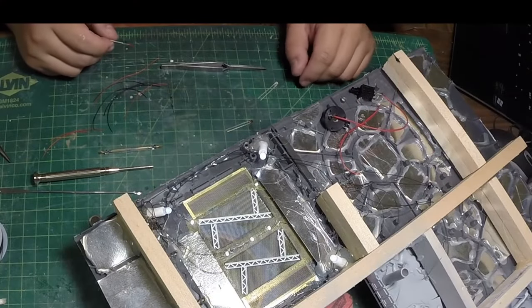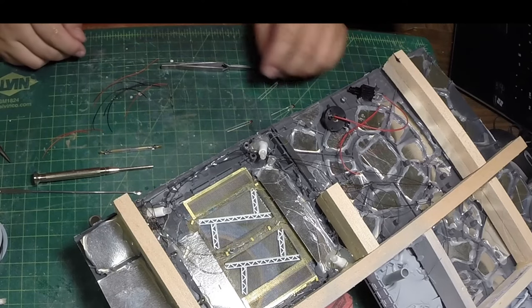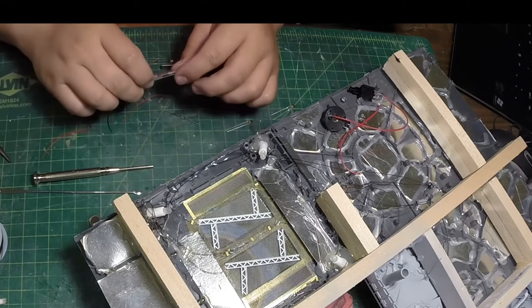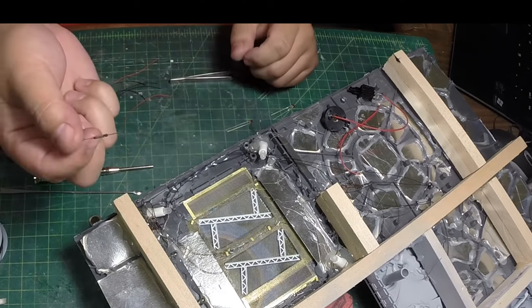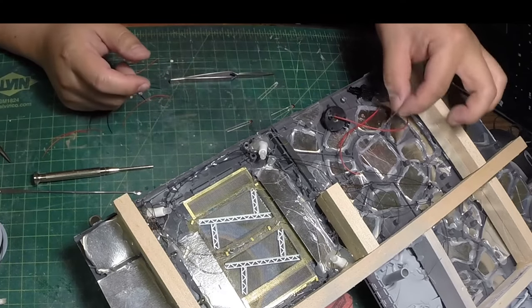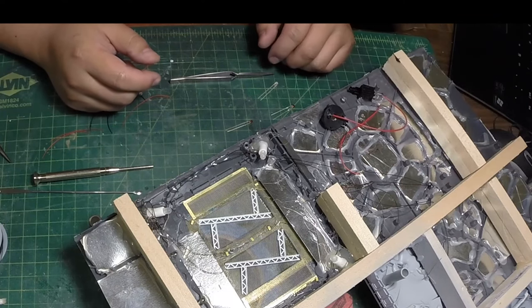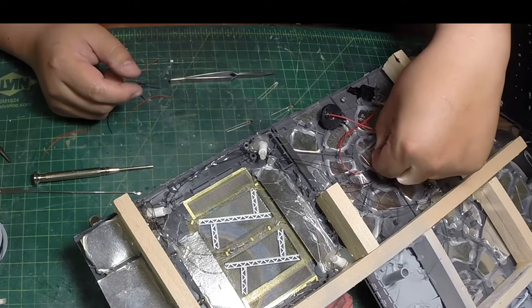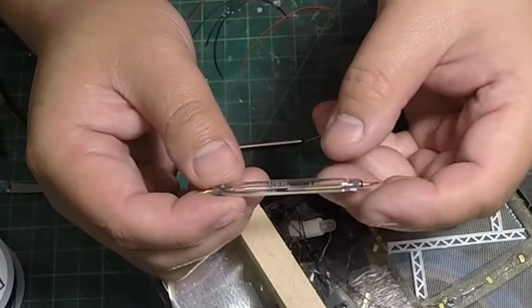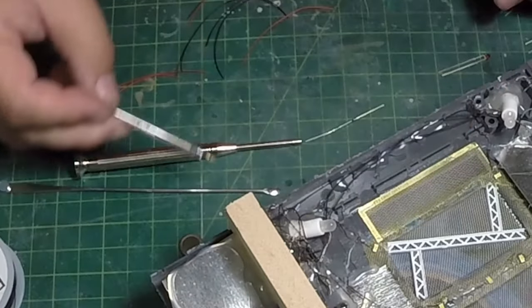What this means is I'm going to have to rewire this whole thing. Since I'm rewiring it, I'm going to try to be clever and add a reed switch. This is a big reed switch, this is a tiny reed switch, which is what I'm going to use here. I'll put the reed switch at the bottom of the base, and on top I'm going to have a magnet activate the reed switch. That's how a reed switch works — a magnet attaches and the two ends of this vacuum close up, closing the circuit so that power flows through the system.